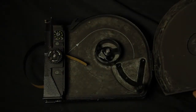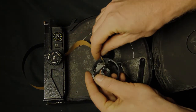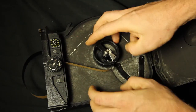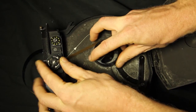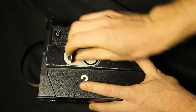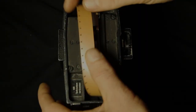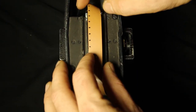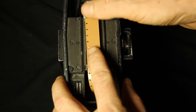To secure the film in the take-up side, you will need a core attached to the core adapter. Fold the end of the film and put it into the notch on the film core, and then place it back on the stem. Roll up around 5 revolutions until it's nice and snug, and move the film roller into place. Now close and lock the chamber door to the take-up side and reset your clock to zero. Now, apply the film loop to the pressure plate, making sure the film rests on the pressure plate without scraping against the sides of the magazine or bowing up off the plate.